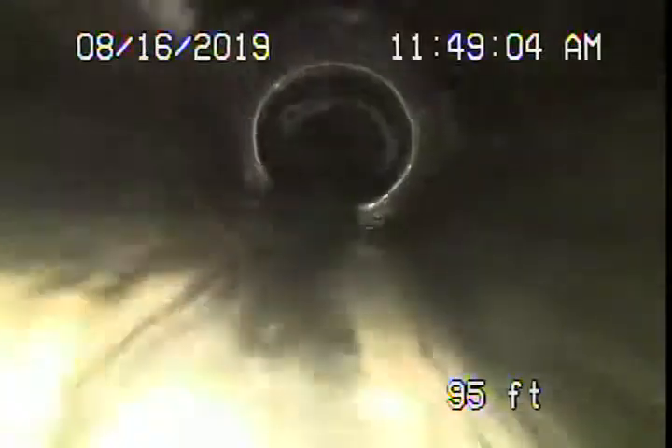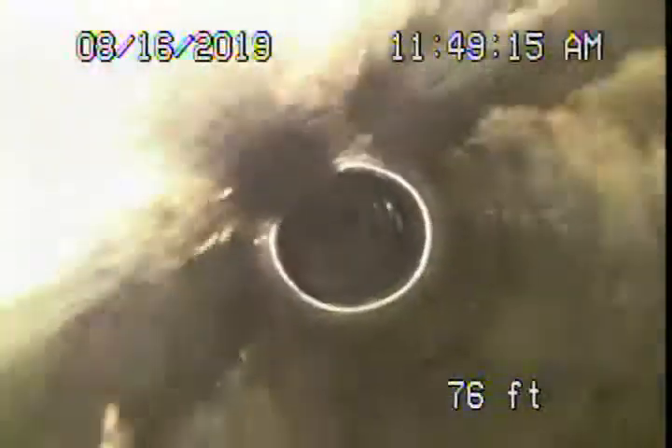Coming back from here, we're now inside the property. We've got ABS plastic — this is the main line that we're checking. We cannot check every pipe in the house; the general inspector will check underneath the house. But the ABS plastic main line, running all the way through the front yard and coming underneath the house, looks like it's in pretty good condition so far.